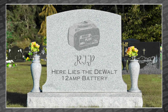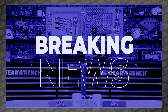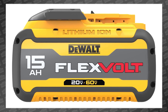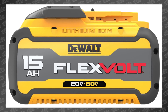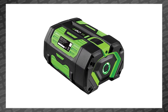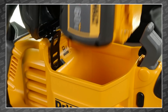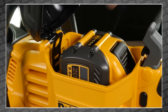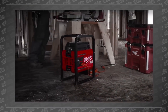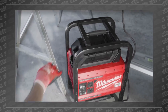These are absolute monster drills and consequently they'll eat a 12 amp hour battery for lunch, which brings us to the bigger news: the Dewalt 15 amp hour Flexvolt battery. To put this in perspective, that's about the equivalent of an EGO 5 amp hour battery. This does open opportunities for Dewalt's expanding OPE lines and suddenly expands the capacity of their inverter to an impressive 1,080 watt hours, beating the 864 watt hours of the Milwaukee MX Carry-On by 25 percent.